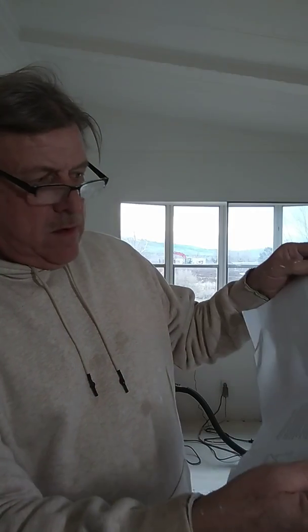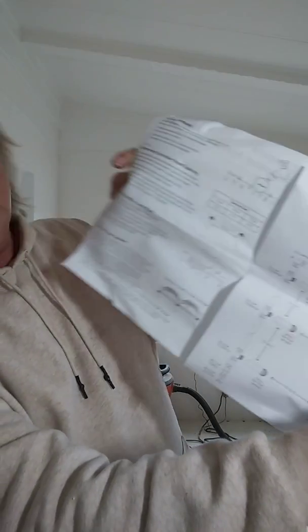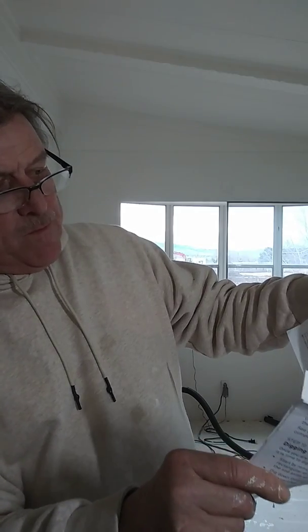So you start out by putting this pressure gauge on your hose bib, and it tells you how much pressure is coming out of your hose bib, and that will tell you, as per your instructions here, it will tell you spacing chart, okay? It will tell you how many sprinklers you can have and how far apart they have to be. So the pressure, you know, gets less and less with the more sprinklers you put in, logically. So if you have less pressure, you're going to have to put the sprinklers closer together so they work properly.